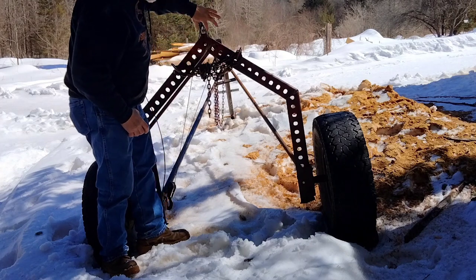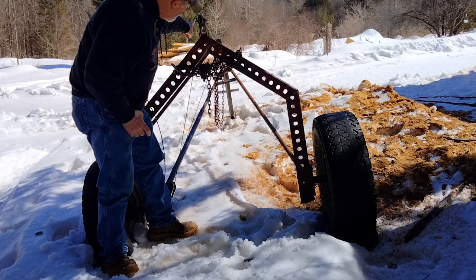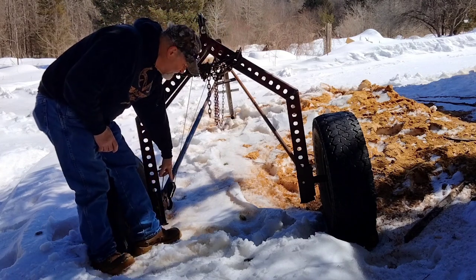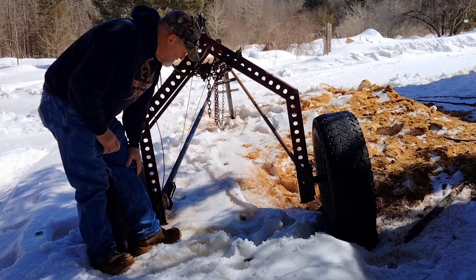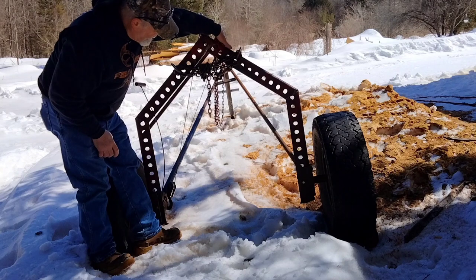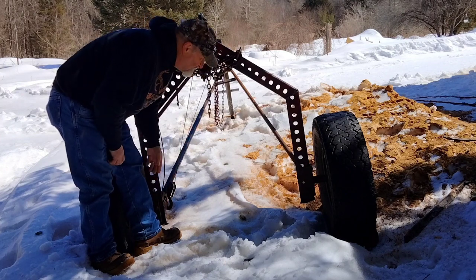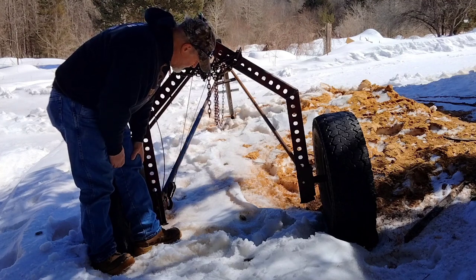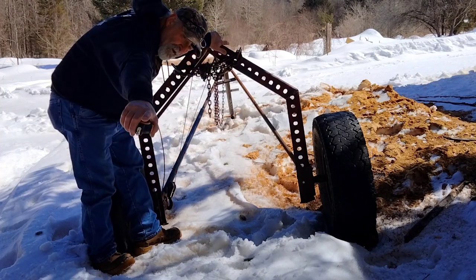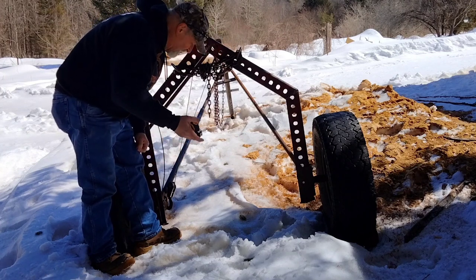Up top I mounted a pulley for the winch. The winch is mounted on the front of the trailer and the cable comes down through this pulley, which drops straight down. On the bottom there's a small snatch block — you can buy these at Harbor Freight. That snatch block doubles the lifting capacity of your winch and makes it a lot easier to pick up a log, though it slows the winch down a bit. If you're dragging a log to the arch, you can unhook the cable from here and hook it straight out to a chain around the log to drag it in — dragging isn't quite as demanding as lifting.